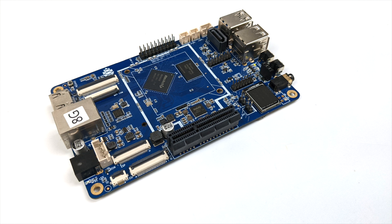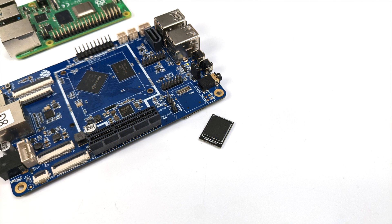I'll leave a link to the website in the description — I'd highly recommend reading through the spec list. One thing I love about these Pine boards is most accept an eMMC module, which is much faster than a micro SD card. We can boot from micro SD or eMMC, and right now over on their wiki you can download the Android 11 build. It's a beta build, but I've installed it to a 16 gigabyte eMMC module and that's what we're looking at in this video.